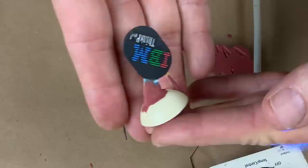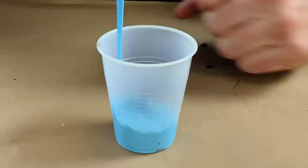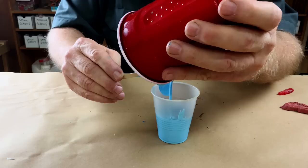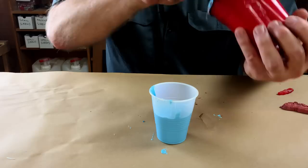We are ready to pour some rubber. I mixed up a batch of rubber and I want to pour it very much from the bottom up, because I want to get all of the details in that little badge — all the lettering. I'm going to pour from the bottom and make sure that the rubber rises up through those letters, just flowing upwards and pushing out all the air. People ask how I know how much rubber to mix up — the answer is I just eyeball it most of the time, on a wing and a prayer and experience. Sometimes I'm dead on, sometimes I have to do a topper batch, and sometimes I have to add a little rubber to the chunky stash.